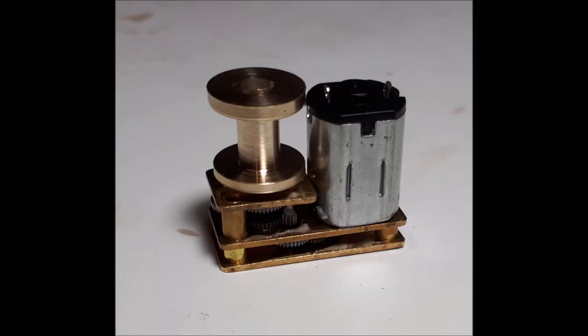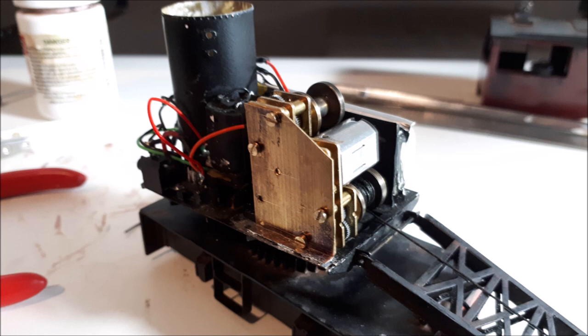The crane needs two hoist motors, one for the derrick, lifting the jib, and the other for hoisting the hook. The necessity of having a large battery meant that there was only limited room available for these motors, so I ordered a pair of flip-type gear motors, both of them at 40 RPM, rated at 6 volts. These are motors that have a gearbox that extends sideways and the output shaft faces the other way, 180 degrees from the normal position. I fitted a little brass drum turned on the lathe directly to the output shaft of each of the gearboxes, and the drums have a small hole drilled in one side for the hauling line to pass through, which is then fixed by tying a large knot on the other side.